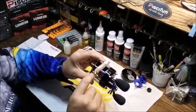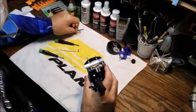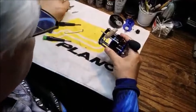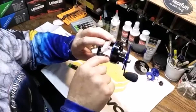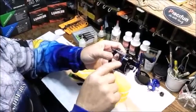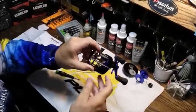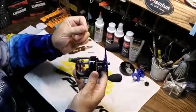I want to test to see how tight the cap is. I want to make sure that that cap is tight — it certainly is. If the cap isn't tight, what will happen is that there's a little cam inside there, a little dog-eared cam that rides inside those grooves. And what happens if this isn't tight is it won't ride properly — it'll skip over and you'll start getting too much line on one side or the other of your worm gear. That's one of the things that causes that, other than just wear and tear and corrosion inside the worm gear. So far as I can tell, this thing is built like a tank.